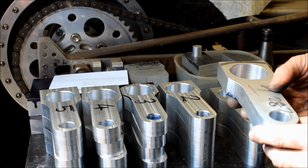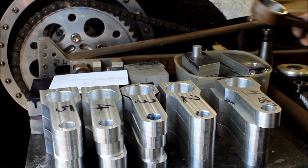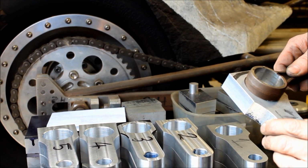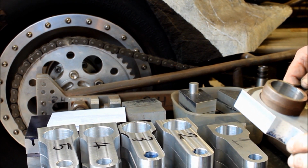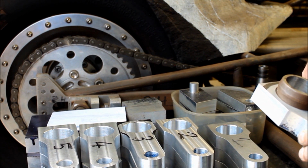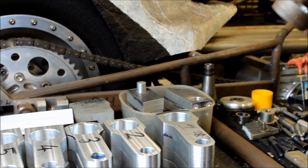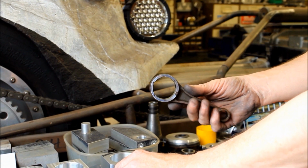And I see you've got a conrod there, the old conrod. From Kawasaki, that's the old Kawa one. What we've got to do is saw that off and grind it, and then that ring will be pressed in. We want it to press in, but we don't want it too tight, not too tight, not too loose, because it's going to put pressure on the aluminium, which we don't want. It'd be nice to do maybe about a couple of thou maximum.